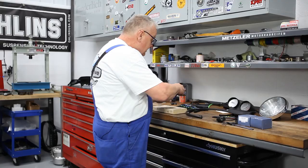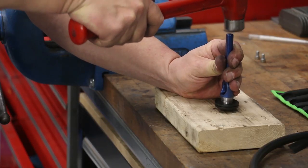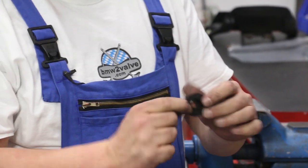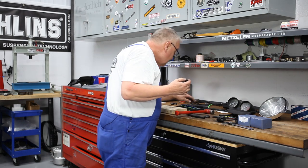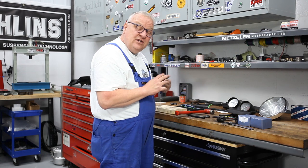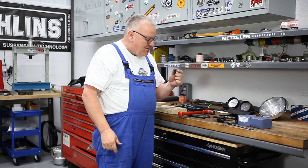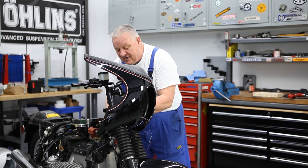Just set that right in the middle, nice and centered, and then give it a nice little wrap with a hammer — make sure it's nicely centered in there. We got a really nice clean centered hole in the grommet. The other size I need on this one is a 10, and we have a 9 — a little interference fit is a great thing. Perfect, grommet ready to reinstall.